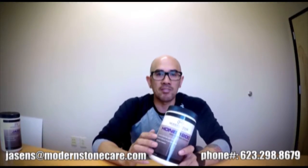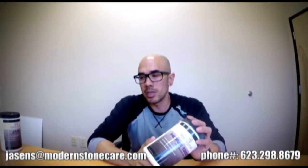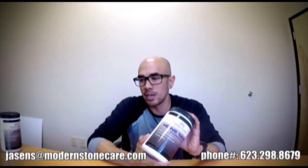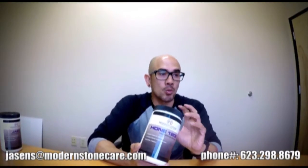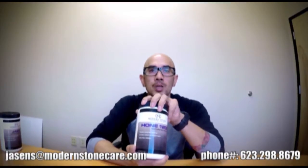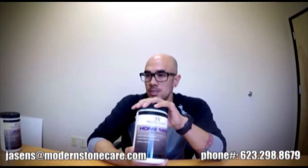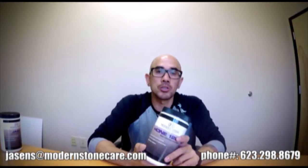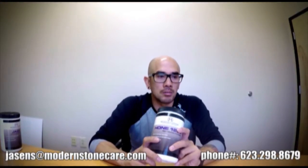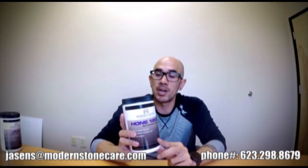Beyond that, I tend to lean away from using honing powder. For marbles and granites — especially granites — I don't even really consider using a honing powder. Honing powders do still have their place in the industry, but normally it's going to be as a finishing step. Back when I was doing this for a living in '99 and early 2000s, we would be taking multiple steps with the honing powders — quite messy, quite labor intensive, a lot more time consuming than using some of the other approaches out there now. But this was the standard technology in the industry. We still manufacture them, and contractors are still using them to even out floors and to work around some challenges on uneven surfaces.